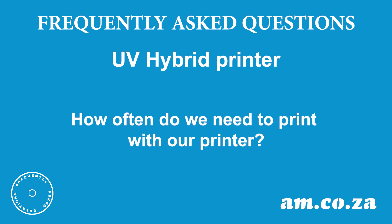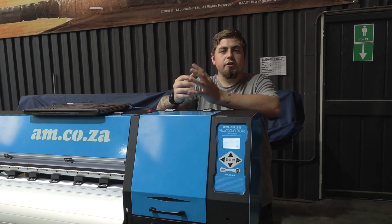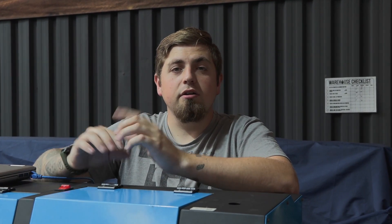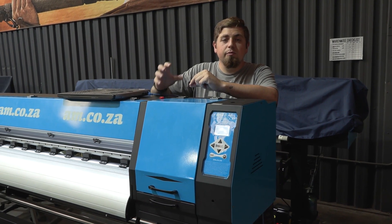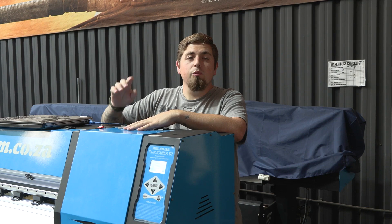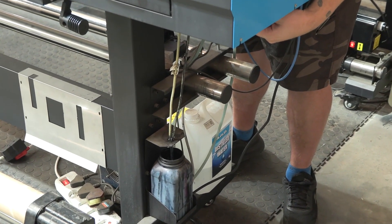How often do we need to print with our printer? This is more about keeping your head from drying out. If there is no UV light present, your ink cannot cure, so having your printer in a dark place really does make a difference to keeping your head wet. Make sure your head stays capped perfectly, aligned, and cleaned so that no air can get in and cause dryness. UV ink does separate in the bottle and ink tanks over time, so give them a good shake before pouring into the ink tank and stir the ink tank manually. If you have white ink, leave your printer on so the agitation stirrer keeps stirring it. Also, clamp your waste pipe so that no air comes up that pipe and dries out the capping station.